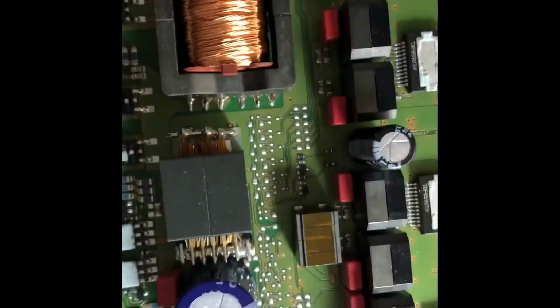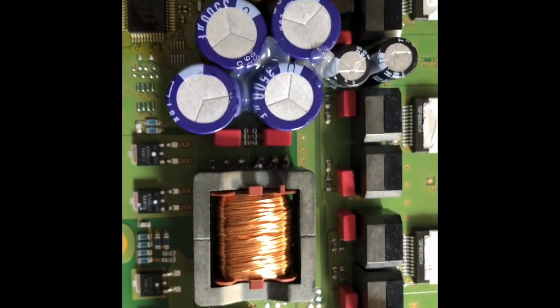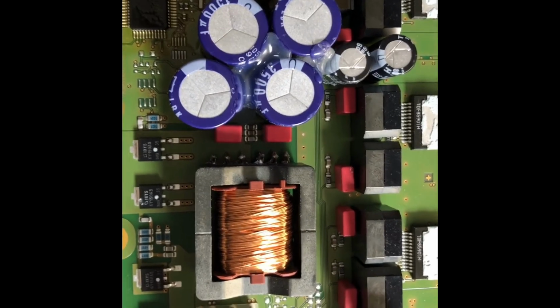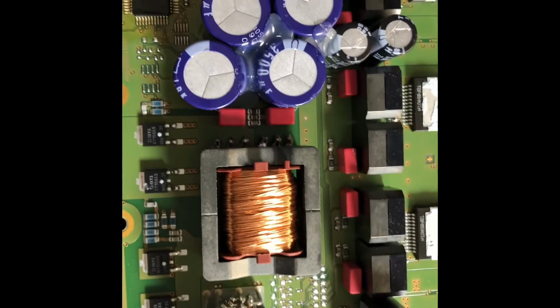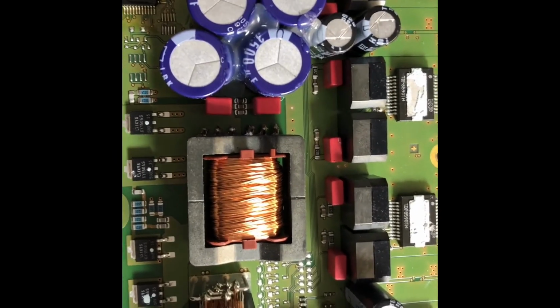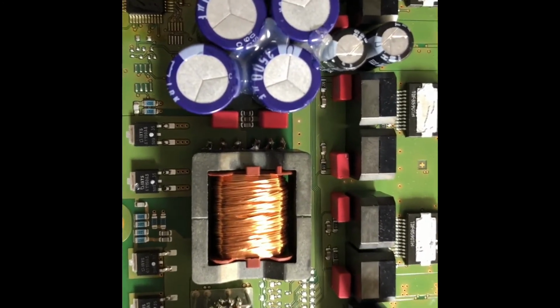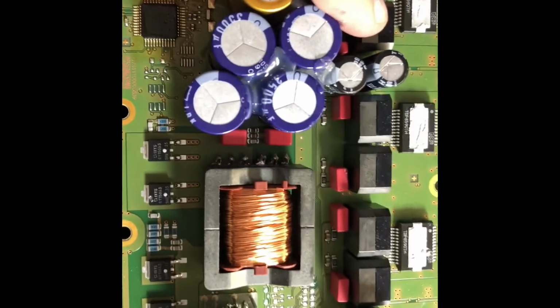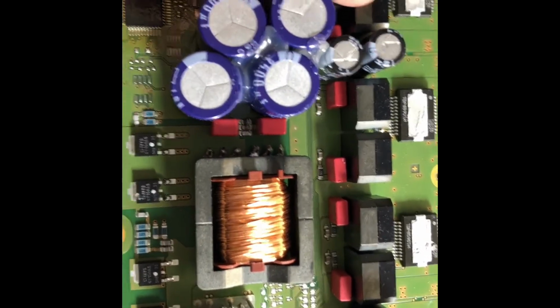Well, we fixed the amplifier, but I'm just saying I was a bit surprised that they were trying to upgrade the amplifier, which is already pretty good. I mean, this is Class D. Class D amplifiers will never sound like Class AB, for example, because it's a different concept. They have better efficiency, of course, but for sound quality, whatever capacitors you install, there is a thing here. You can see that it's not linear gain like Class AB.